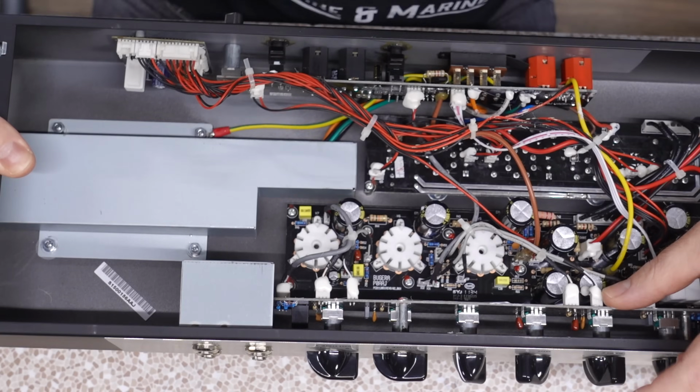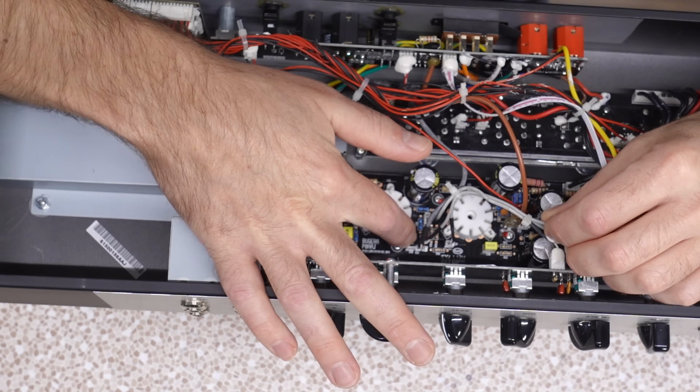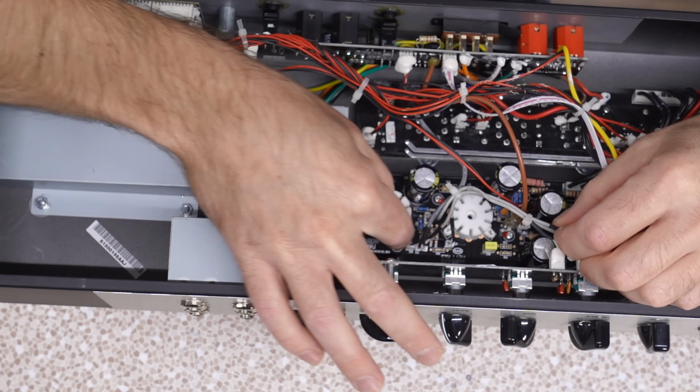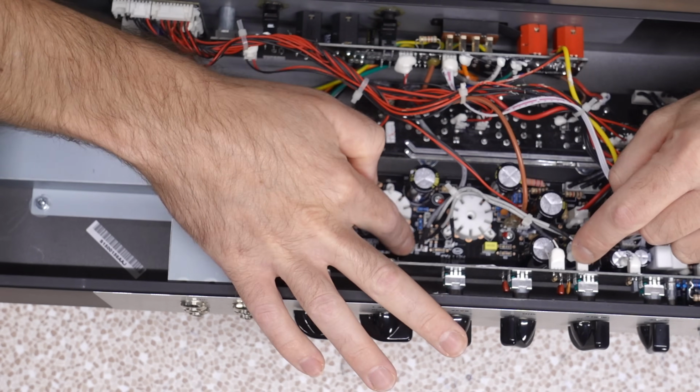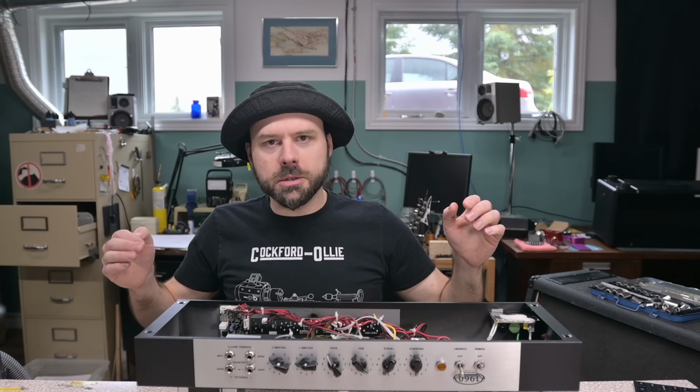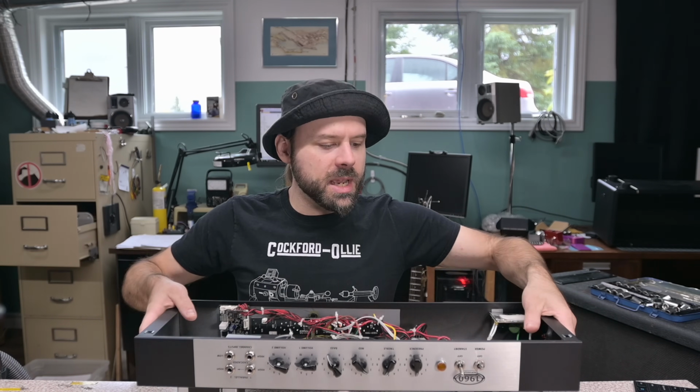Yeah, that's right close to the treble knob. And that feeds down into X32, so they kept the same part numbers. That's perfect, bud. We just have to take this one wire between there and there, intercept it, and route that to a master volume knob. A master volume mod on this amp would be stupid easy.